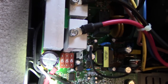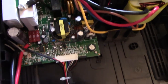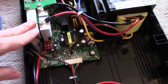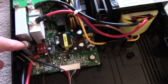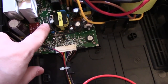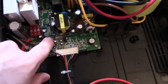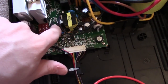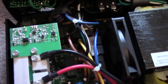This one realistically is probably not that bad because it doesn't really cover all that much stuff. But just for completeness — since this is one of my personal units — I'm going to take everything out of here including the board and clean it all. At least they didn't put any down here on this TO220 and this capacitor, because that's where there's a bunch of SMDs that usually get covered, and that can be a real pain to clean off without breaking anything.